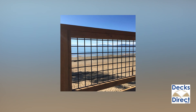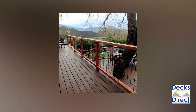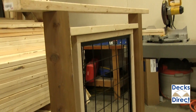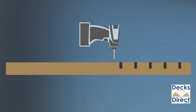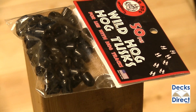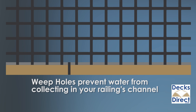Now let's take a look at what you can do with the Wild Hog panels. Wild Hog panels provide an amazing rustic look in a wood frame. Many projects begin by building a wood frame around all four sides of a panel and fastening the frame between the posts. This can also be achieved by pressing the end of a panel between two lengths of wood to make up one post and doing the same on the other end. Using a router to cut channels into your wood posts and rails can conceal the bare ends of the panel, maximizing viewing space and cutting down on weight. For heavy gauge Tahoe panels, you can drill holes into the deck rails and posts for a similar effect. Adding rubberized hog tusks will help prevent corrosion at the bare ends of Wild Hog panels. Drilling weep holes for rain into your bottom rail will also help preserve metal and wood alike.